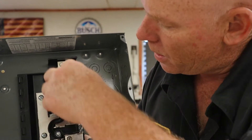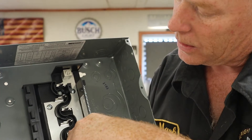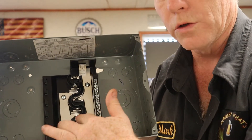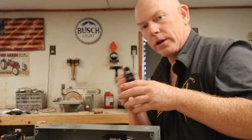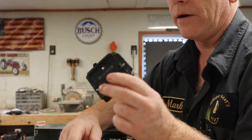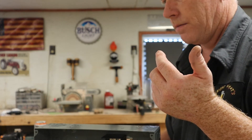The inside of your bus bar — this power wire is going to be grounded, and it'll also have a neutral, but it'll jump from this post to this post to this post. Then this bus bar will power this post, this post, and this post. That's important when you're trying to hook up your 240, because this slot is 120, that one is 120, and so on. For a single pole breaker — what they'd call single phase — you're going to have the black wire coming in as your hot wire. The black wire is your hot, the white wire is your neutral, and then it's either a green wire or bare copper for ground.